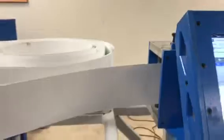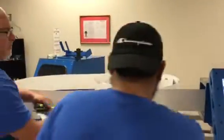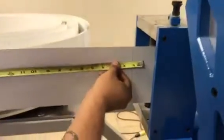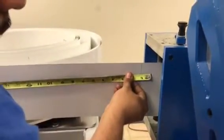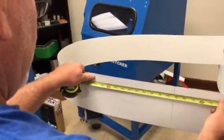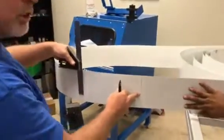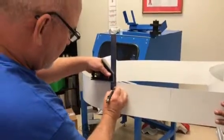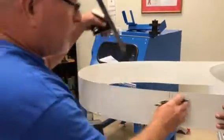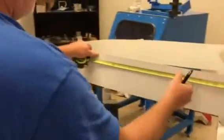From that mark I'm going to measure 48 inches. I'm going to burn an inch, so I'll go to 49. Make sure it's nice and square — go to the top part of the tape. Make sure whoever helps you with this step knows how to hold a tape, can pay attention, and has good eyes. This is very important. Double-check that the person holding the tape is paying attention — Reuben here's a good guy, so we're dead on.